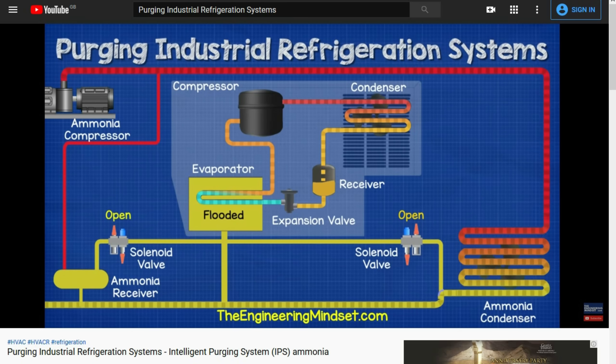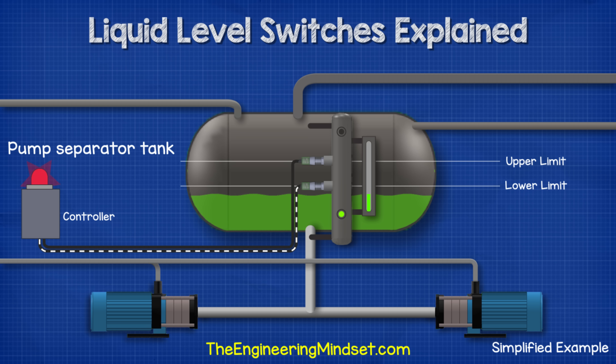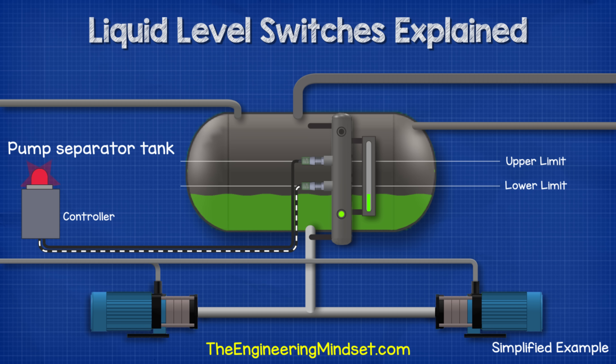Coming back to the column installation, we could face the problem that the liquid level drops. In this case the liquid level is going to come below the lower limit switch. The sensor will detect that phase change from a liquid to a vapor and will send a warning signal to the system controller. Additionally we could face the issue of overfill where the liquid becomes too high in the vessel. This means the liquid refrigerant will rise above the upper sensor. The sensor will also detect there has been a phase change from vapor to liquid and will again send a warning signal to the system controller. In either case the switch activates an inbuilt relay which is used to sound an alarm and can be connected to the system PLC or programmable logic controller.